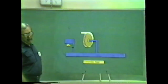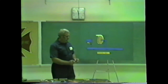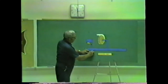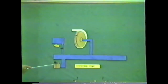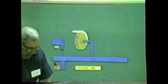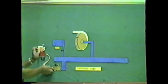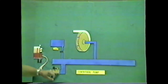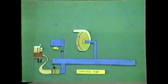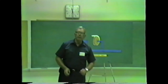Another source of water is another pumper or tanker. All pumpers today are required to have what is called a two-and-a-half-inch gated intake — just a two-and-a-half-inch intake opening that ties into the intake manifold. The primary purpose of this gated intake is so we can utilize water coming from another pumper down the street or a tanker. We just take a hose off that other pumper, bring it into the intake manifold, and direct it up to the impeller. That covers four different types of water sources used in the fire service.